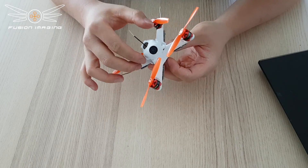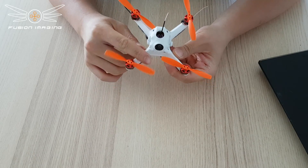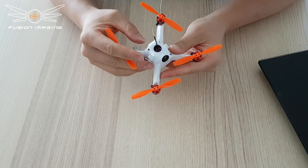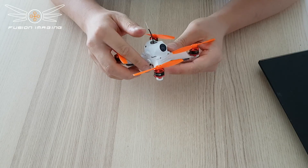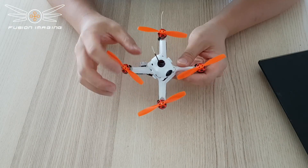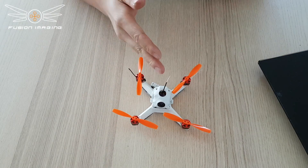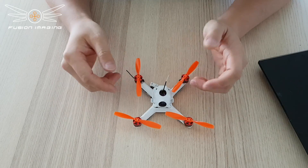The frame is fully printed, so there are some advantages in manufacturing. The exterior is smooth. The shape of the arms is a modified profile of a 9mm Remington bullet round for a low drag coefficient. We've tried wingtips and everything, but this design lets you put an ESC right under it — bullets have a flat back. The arm is actually hollow, which makes it very light, but it's internally reinforced with a series of baffles, like the Titanic, giving you little cell structures inside, like the hollow bones of a bird.